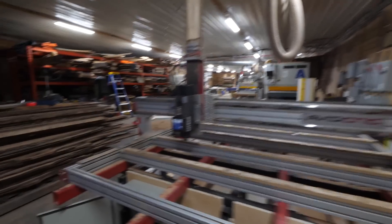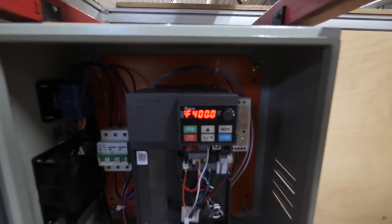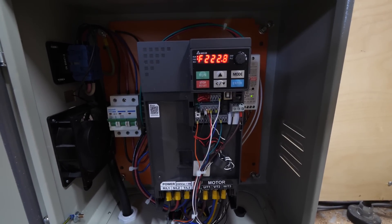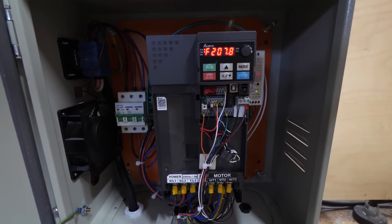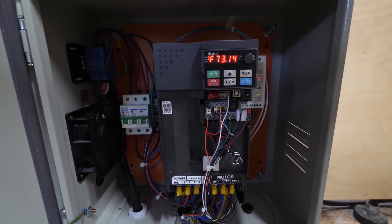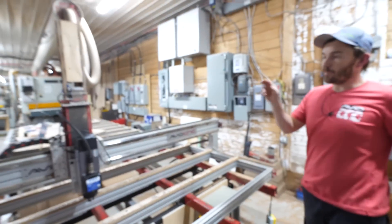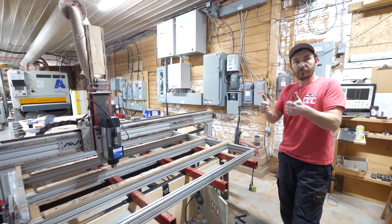Let's go check it out — there she goes. I can adjust the RPM, so I can go down to 12,000 and you'll notice the numbers change — that's 12,000 RPM. I can go all the way down to 4,000, all from the computer, and I'm also able to shut the spindle off right from here. Super pumped. We're going to get the bit in here, surface the other side of the slab, and make some sawdust.